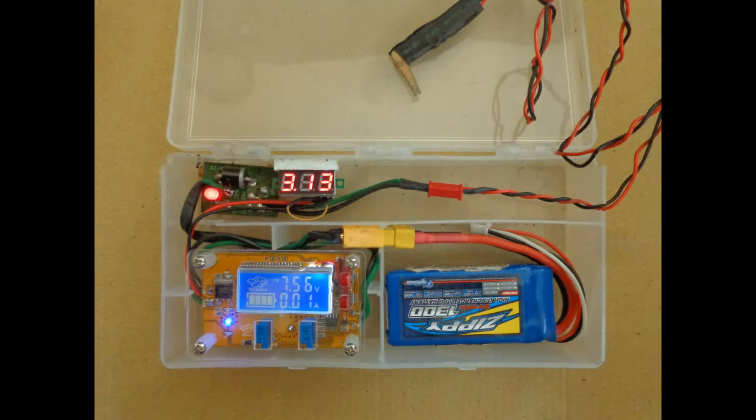You could use it as an automatic battery charger. If you know the float voltage your batteries want and the required charging amperage, you can set up the parameters on the screen. It'll taper off the amps as it approaches full charge and give you an indication of full charge with a blue LED. It's even got a USB output — a standard full-size USB plug — which you could use to charge your phone at the flying field off one of your flight packs.